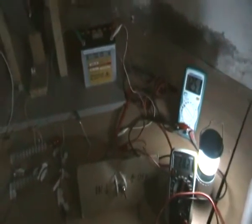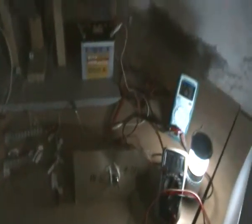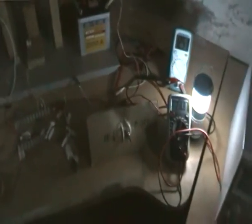So, the research going forward. One of the things which I am currently interested in, and maybe somebody of you can give me information about, is a circuit which will monitor this battery to the level of 11 volts, then just disconnect the system, disconnect one of these green or white cables, just take the current away from the battery when the battery reaches the border, I mean the discharge voltage. So discharge the battery to 11 volts, and then the circuit should just disconnect one of these cables.